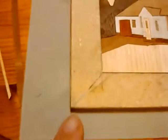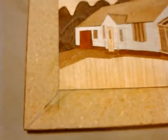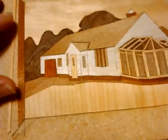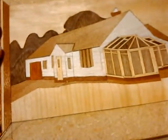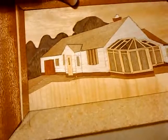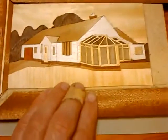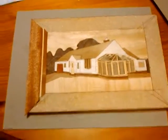I've marked 45-degree lines on the backboard for the borders. It's going to have a dark strip to contrast with the generally light background, then a light strip, then a dark strip, trimmed to the backboard on the left-hand side. I've also cut the angles to match the top. I haven't done the inner filler strip - I'll just do that by eye afterwards. The next job is to glue these border pieces in place, leave them to dry, and then all the edging will be done all the way around.